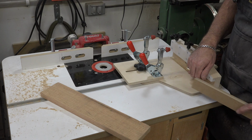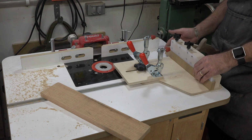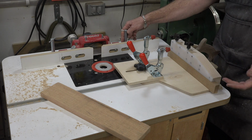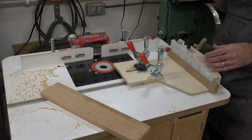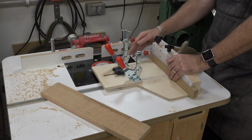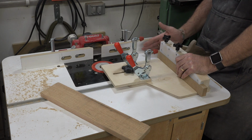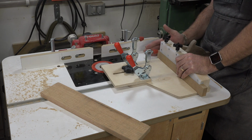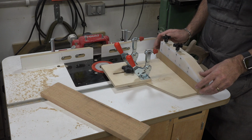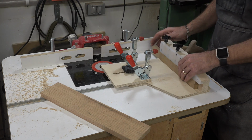So you have your sacrificial piece, and that just slides into your dado that we cut at the first part, and it could overhang to whatever distance you need throughout here. You would set up your bit, set up your fence the best you can, and get it out of your way. Set your bit to the correct size, and then you can bring your fence up and have a stop block here, kind of like a setup block. An extra 3/4 of an inch on here that you could slide your stock up to butt it up for your routing. Then you know you're in the right position.